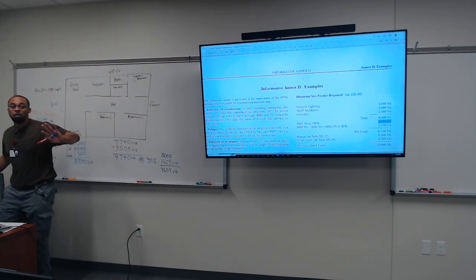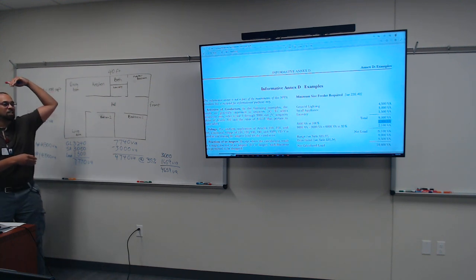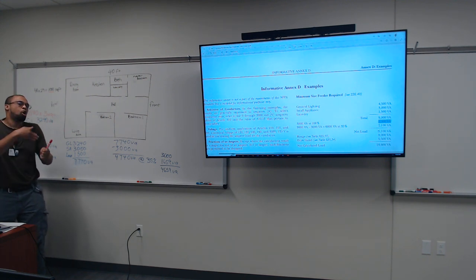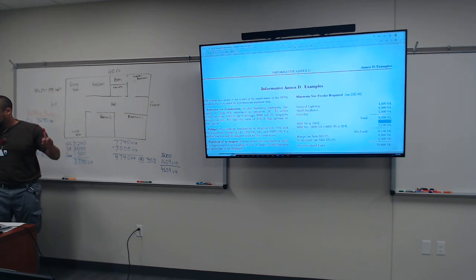So right now, we're not doing no laundry. We're not doing no dryer. We're not doing no fixed appliances. We're not doing none of the extra stuff. Right now, we just wanna see if our general lighting along with our laundry and our small appliances serves us right, or what we calculate. Yes, sir.